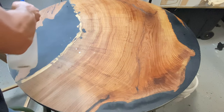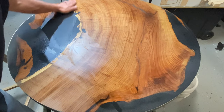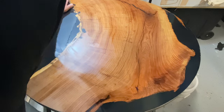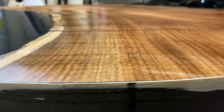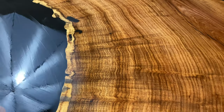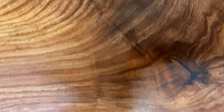I've sanded it up to about 100 grit and I'm doing a quick water pop just to get a preview of what it's going to look like when it's done. I always love this part — it kind of keeps you motivated and you can see what you're working towards. A lot of work left to be done but I'm really liking how this is looking. At this angle you can really see the grain and the figure in this Texas mesquite — just wow, beautiful wood.